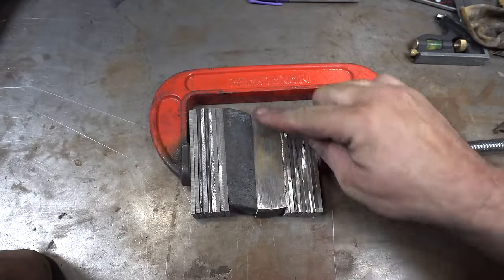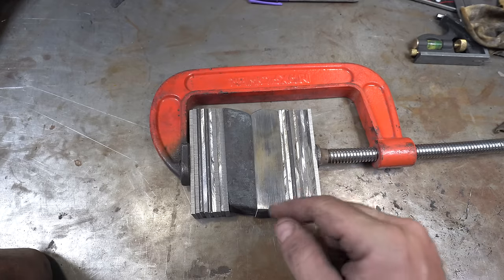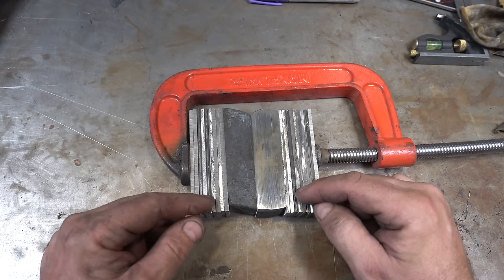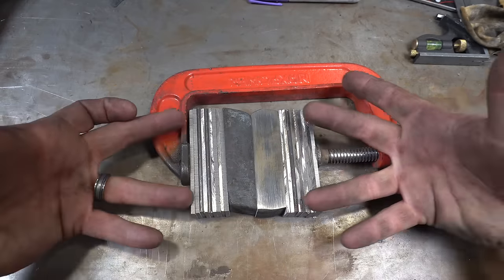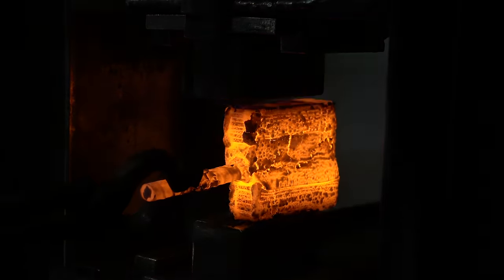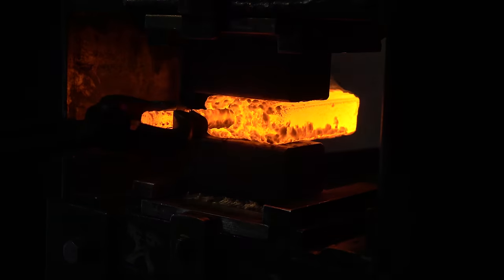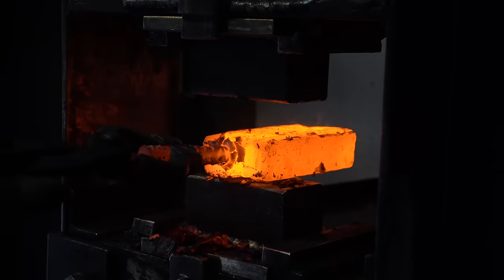Here we are so far — we split the feather, I've ground the sides. This one was a little thicker, so I ended up pressing and grinding it a bit to get them all the same. I've taken a bunch of 1080 — this just happened to be the thickest 1080 I had — and I've stacked this up. You'll see in the next step what I'm going to do here. So now we're going to forge weld this all together, square it up, and draw it out a little bit to get the length that I need.